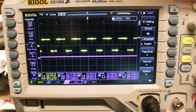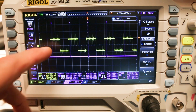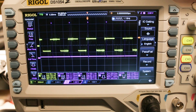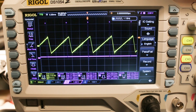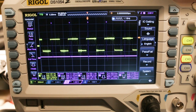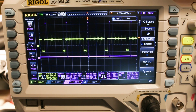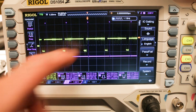Let's get back to about 100 hertz. Let's try to change the waveform — we have the yellow input here. Let's try a sine wave, or triangular, ramped or inverted ramped, and we can go back and try the pulse, and even inverted pulse. As we can see, no matter how long the signal is, we do not get anything longer than the designated on time. The frequency gives only a 300 microsecond long signal no matter how long the audio signal is.